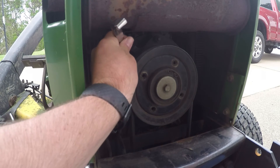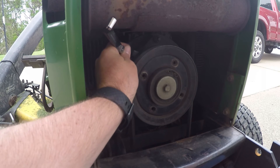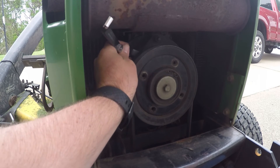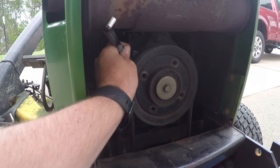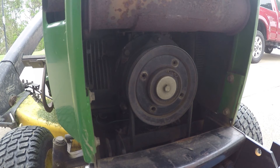You'll go up here and put your feeler gauge into the slot. What you want is a slight amount of drag — you don't want it to be too hard to put in there, and you don't want a lot of slop when you move the feeler gauge back and forth. I recommend doing this at least at the beginning of every season to make sure that the gap is correct. It will ensure that your PTO clutch has a long life and can also help alleviate some of the problems you might see with these clutches, such as not wanting to engage or disengage.